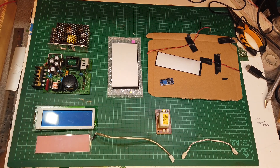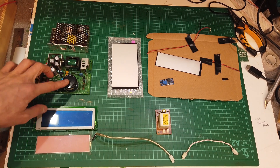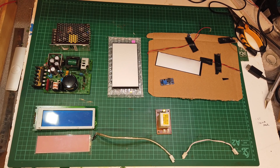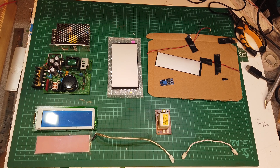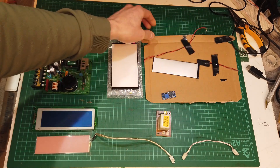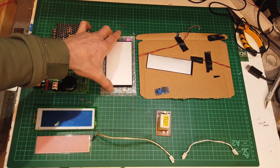The best solution is to make your own backlight, which is what the equipment here is for. I've identified both faults: the power supply and the backlight — these seem to be the most common problems on these units. I'm going to cover them in two separate, shorter videos rather than dragging this one on. I've already made a replacement LED backlight from a cut-down iPhone 6 backlight — it took me two screens to get the cutting right, so I'll walk you through that properly.